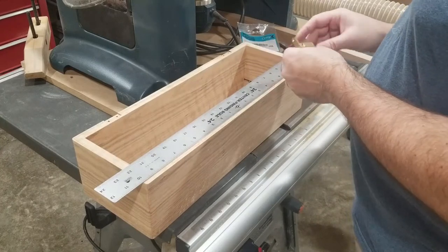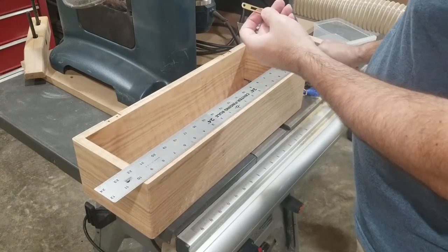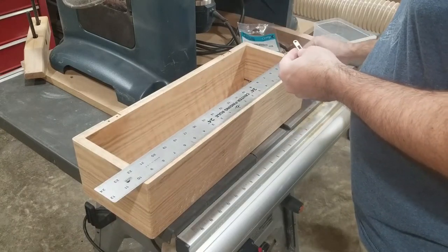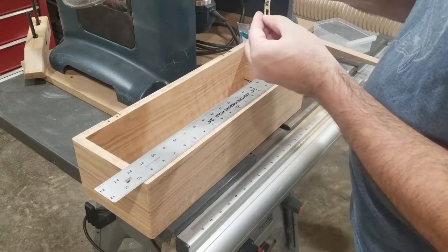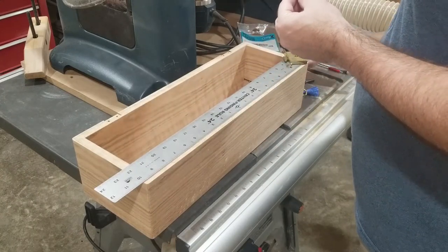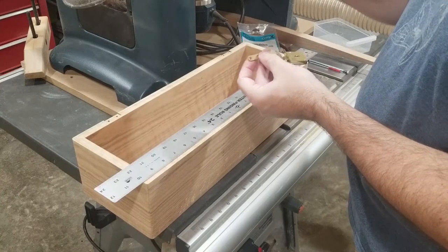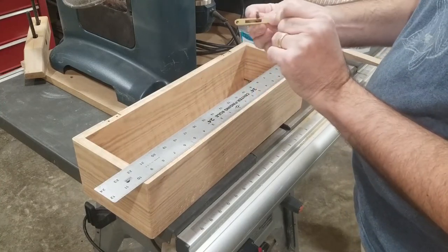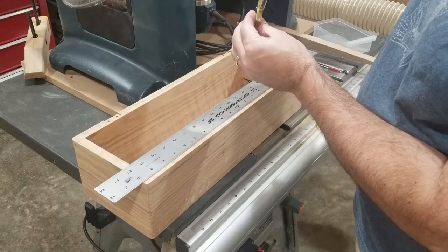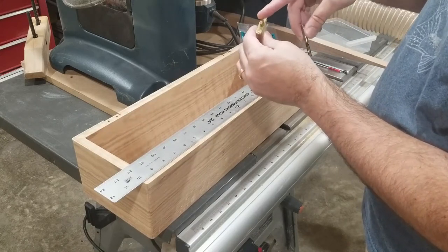Now the third bit we're going to use, generally you wouldn't need to use a third bit. However, with this particular strike plate that we have, it's actually not the same thickness as this one. However, I'm going to probably use the same thickness because I don't really have a medium range bit. So I'm going to use this bit. I did a test cut already. It's slightly more room. But rather than using this thinner bit to clean up the edge, because that'll end up being too small, I'm going to use this much smaller bit to make the plunge for the lock, actually where it's going to go up and through this. And this one actually is significantly smaller, so that should give us enough room to put this in without having too wide of a space up into the top piece for this lock set to fit.